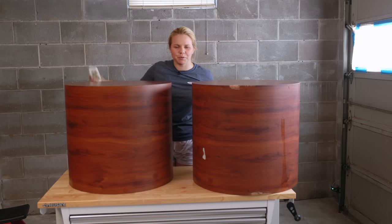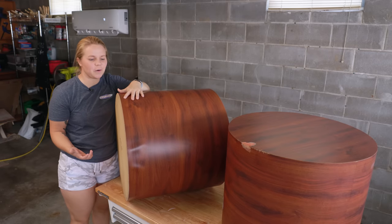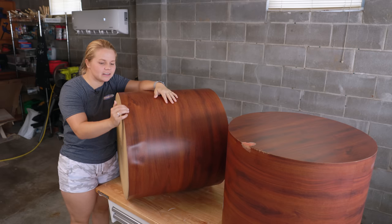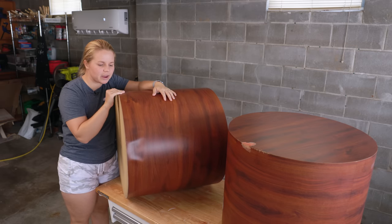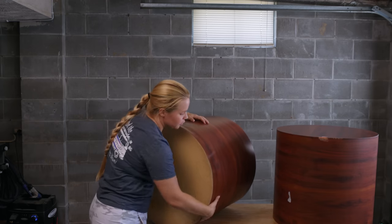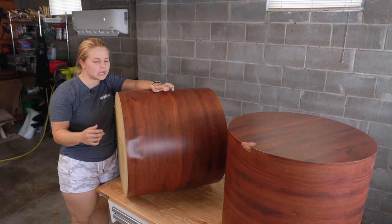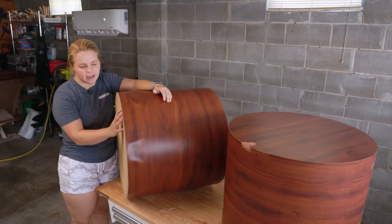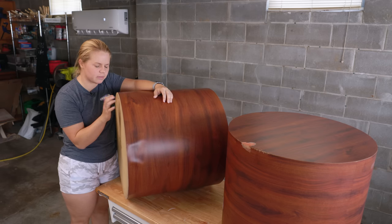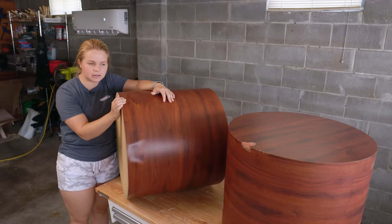All right, it's time to make some repairs. There are two different things going on with each table. Down here on the bottom edge of this table, we're having a lot of lumps and unevenness — it's kind of wrinkled. My first guess would be some type of water damage under there, although the bottom particle board area isn't really totally messed up. So I'm going to go ahead and cut back some of the laminate and see what we're working with under there.